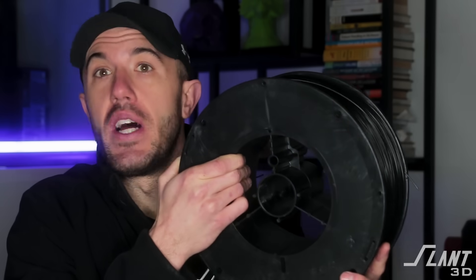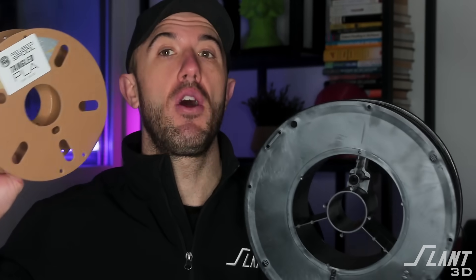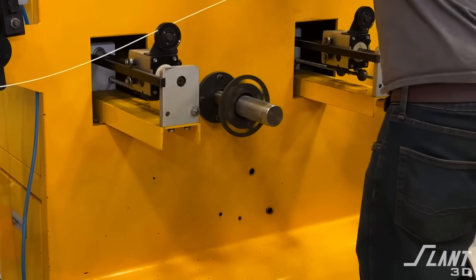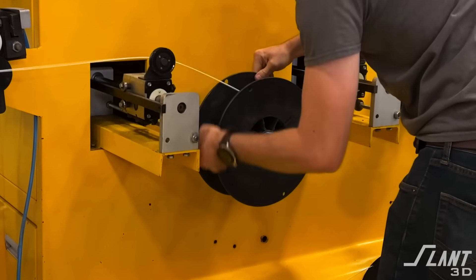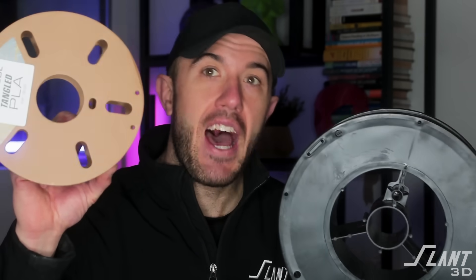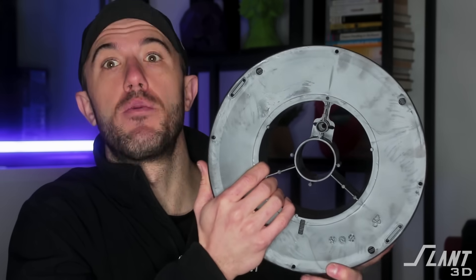The 4kg spool also allows us to continue to scale up, because as we increase the speed of our extrusion lines, the smaller spools fill up too quickly. Without more custom machinery we can't have them spool up fast enough and keep a person up with removal, transitioning, and packaging. The 4kg spool effectively reduces changeover time by four times, so we can run our extruders four times faster without as much changeover — and that lets us radically reduce the cost of filament.